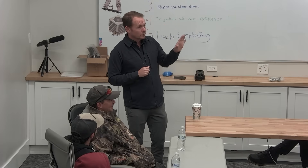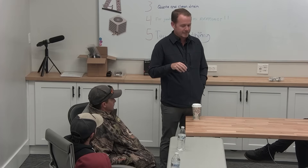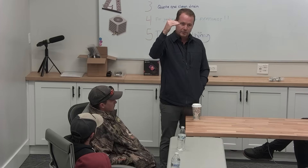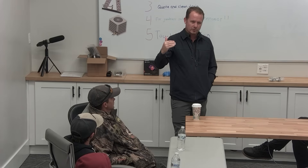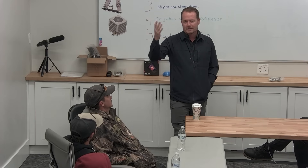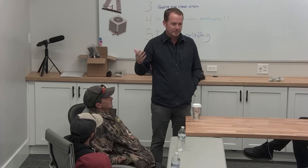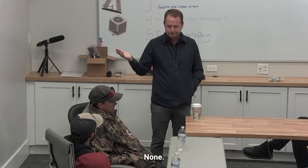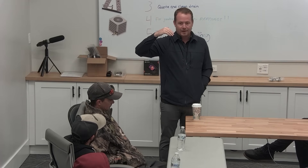When checking your charge in heat mode, there are some rules of thumb you should know - we'll go over those. We're deploying some LMS training that goes through those rules of thumb so you can make sure the equipment's working properly. But that's different from a system not being charged. How much charge are you actually adding or removing from a typical residential garage changeout? None or very little - there's not a whole lot of charge adjustment that generally needs to happen. It's when you've got a 60 or 70-foot line set and an air handler on the second floor that you know you're going to have to take a little more time.